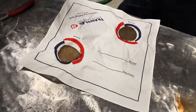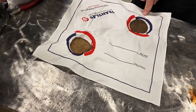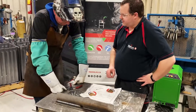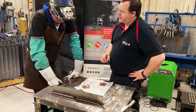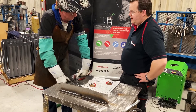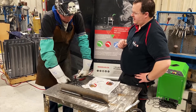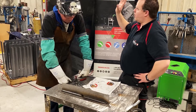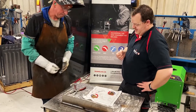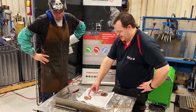This is the result, John. This is 10 seconds of your welding. This is 30 — you can see how much more particulate. Now imagine eight hours of welding. And it's a really nice feeling after two weeks when you remove the tray and it's full — three, four inches of particulate built up. Because now that fume didn't go all across the shop, you didn't breathe it in — you collected that problem. That just gives you some proof from your own welds: what you just pulled out in 10 seconds versus 30 seconds.